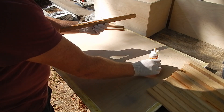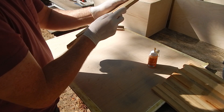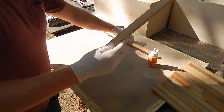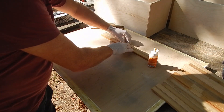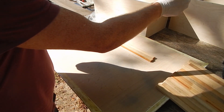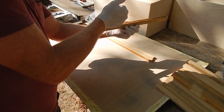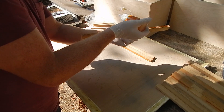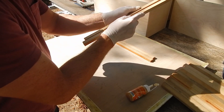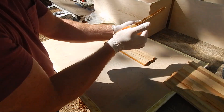Of course it would be more interesting if it were curved, but for this purpose I'm just trying to get an example that's one square foot of flat panel. And so I'm just going to edge glue them with this urethane gorilla glue, which is waterproof and it lasts really well, it's light, it's foaming — it has a lot of really good things going for it in a situation like this. People building boats often use epoxy instead because it's even better and more of a proven thing. But here I'm just applying a bead to one side and then smearing it in with what will become the next side or the next strip, so I only have to apply the bead every other time.